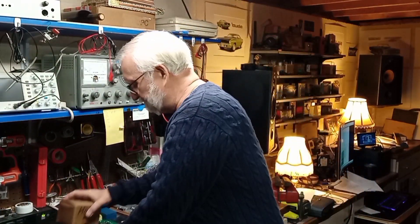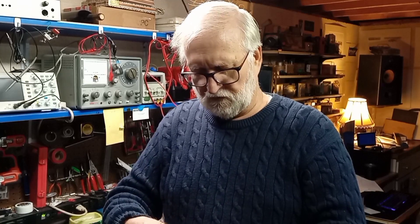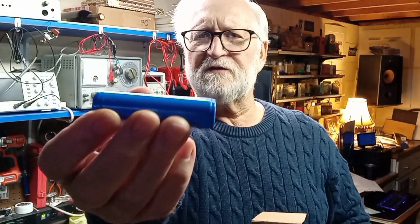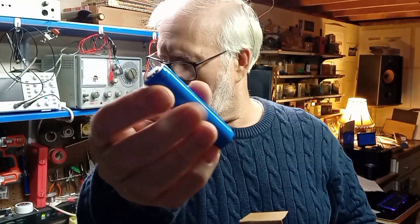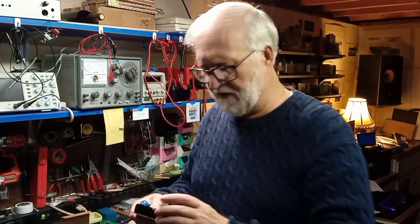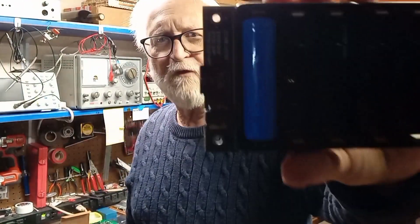I bought a box of these HELIO batteries — H-E-L-I-O — rated at 2200 milliamp hours, and these are nice little batteries. They have built-in battery management on them, little boards inside, so for short circuit and over-discharge they're a little safer than those ones from the Ryobi drill pack, which had no battery protection on the battery itself. The nice thing is they fit perfectly in these 21700 holders, but they won't fit in your standard 18650 holders because they're too long — they fit perfect in these guys.